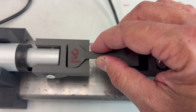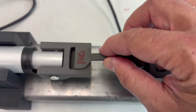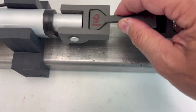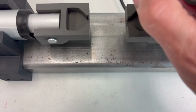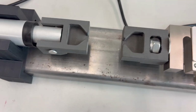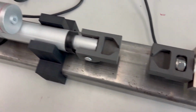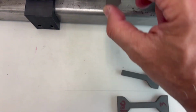One of the things I noticed is that I don't really want to redesign new holders or print new ones. It's easier just to print the bars at a different size. When this sits down in there, it's tight. You can see it's tight. When these actually print, they print a little bit wider than the model. We had some space in there, but it's taken it all up. And you'll see that when I pull these, the majority of them, here's a sample of one that pulled, all break right there at the head.